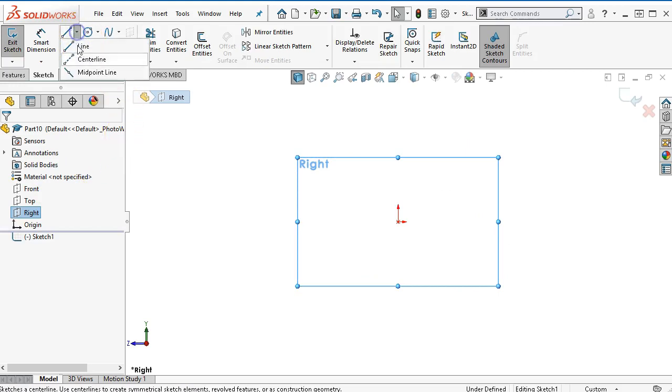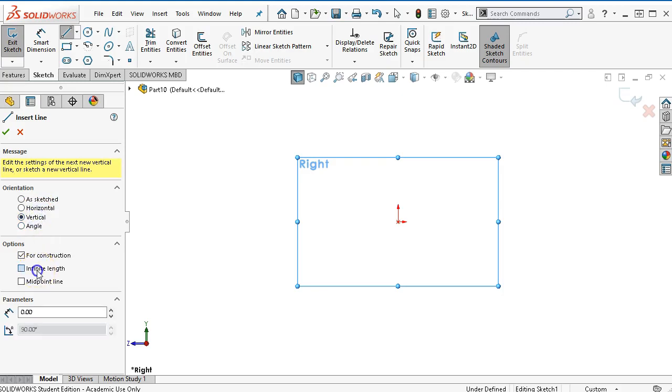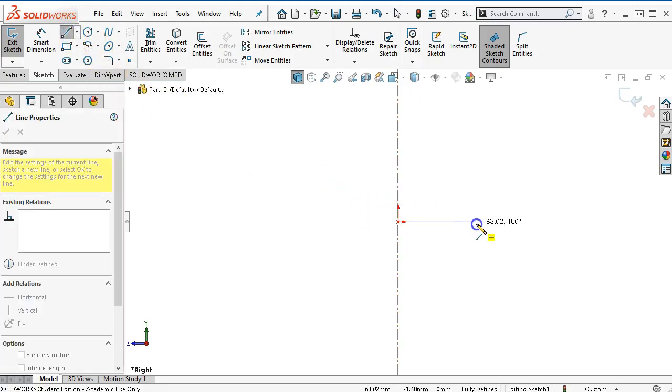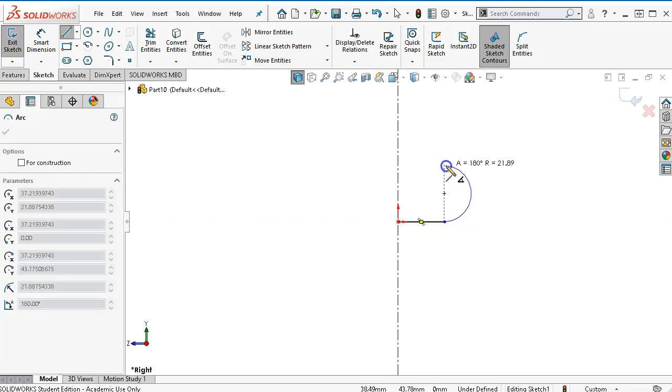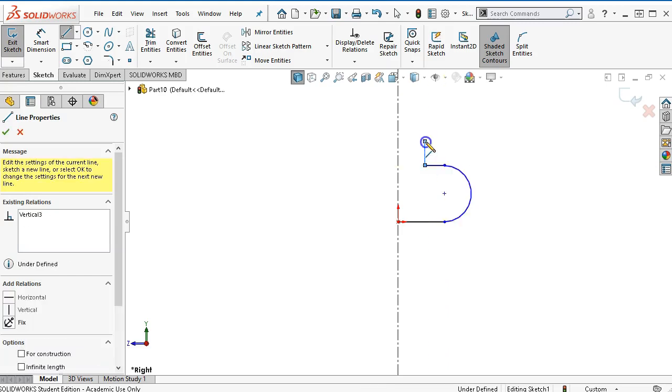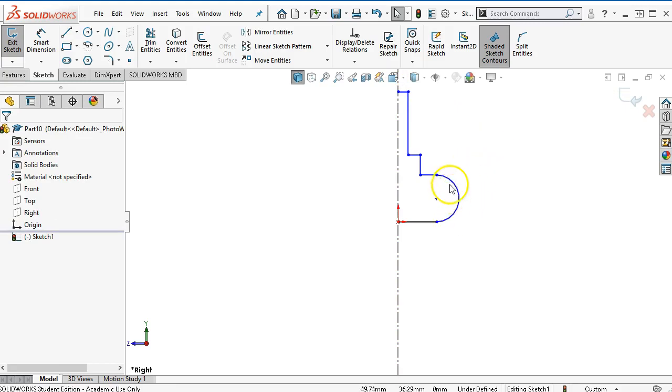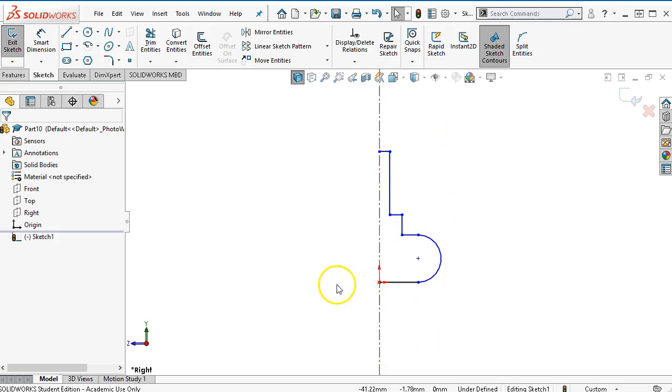Because I know I'm going to utilize that symmetry, I'm going to go centerline vertical infinite length, apply it to the origin, and then click out to make sure that it did what it was supposed to do. It's related to the origin so dragging out some distance — total is about 60 so maybe we'll pull back a little bit. I'm going to use the continuous arc to produce our arc. The radius was called out twelve and a half in two places but was pointing to one section, so I'm making the assumption that when we make the cut it is the true, not the cut-back angle.